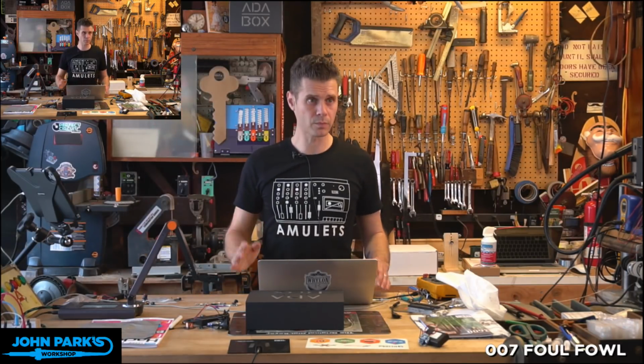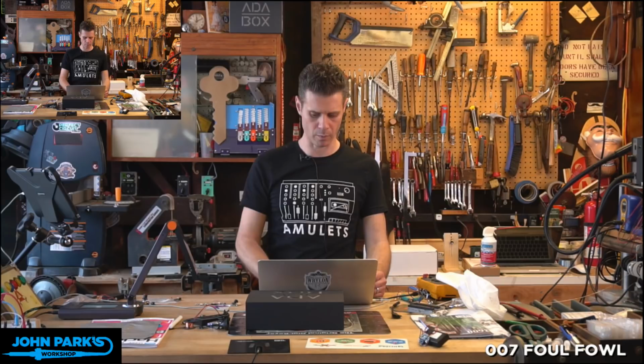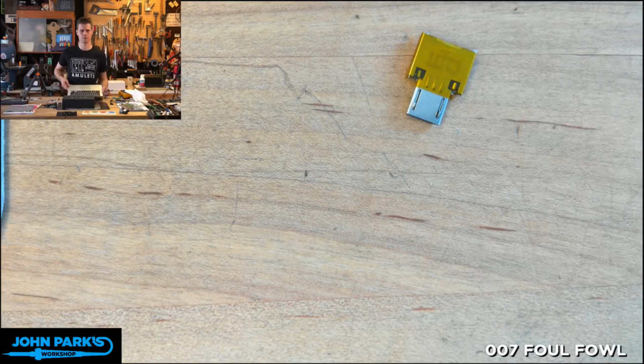Okay. Good. So I'm not going to switch over to the other machine, but what I'll do on this one, I can just tell you, is I'm going to open up the main.py file that's on here. Give you this camera view once more. And I'm going to just change the payload variable from 0 to 1. So here I'll find the CircuitPy drive, and there's this main.py. I'm going to zoom in because you're going to see in a moment we're going to do the full payload on here. So now I'll switch the payload to payload 1 and save this.